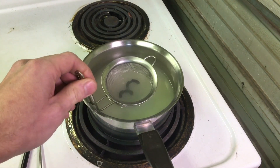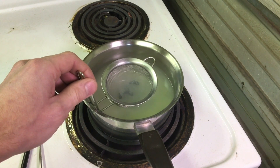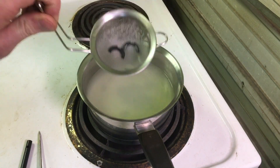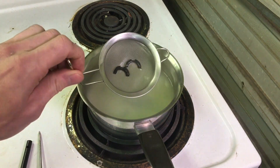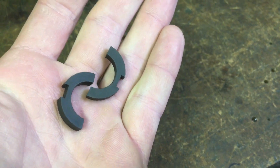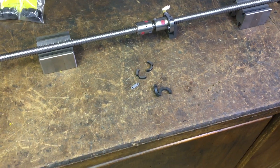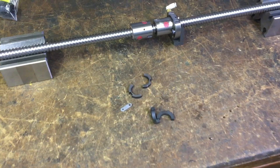For small parts, a little stainless strainer like this is perfect. I'm gonna call it good — go wash them off in some water and we'll carry on. Here are the spacers right out of the Parkerizing pot — they turned out great.